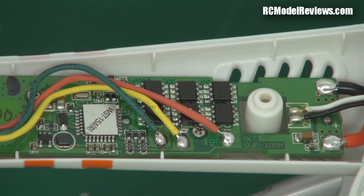So there you go. The weather is a bit crap at the moment for flying, so I'll fly it tomorrow when conditions are supposed to be better. So far my opinion of the Walkera: quality control — as others have noted — the soldering sucks. It wasn't as bad as the worst examples I've seen, but that loose solder ball could have rolled around and blown an ESC. This probably explains some of the unexplained failures people have reported where wires come off and the quad falls from the sky. My original experience with the Walkera Ladybird was brilliant, but this is souring me on the brand.